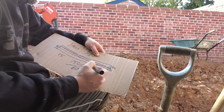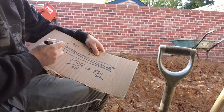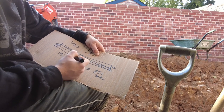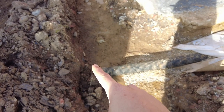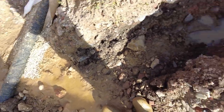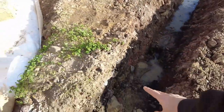the bottom of the pipe, this number equals 250 below. So it starts up here and ends roughly in the same place, so at no point down the side of the building is there going to be anything lower than the land drain. So with them two pipes roughly finishing the same height, I will then need to drop the soil pipe underneath where it connects here roughly, and I've taken this down hopefully far enough so I can still get my fall, so that will work out fine.